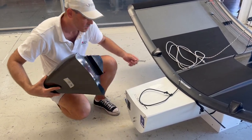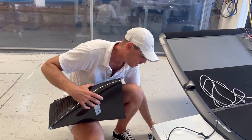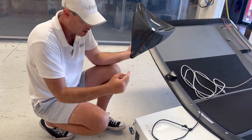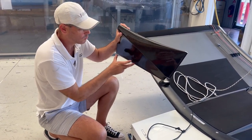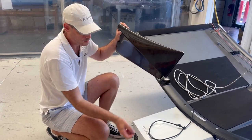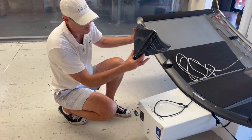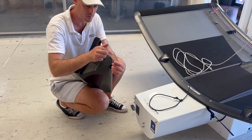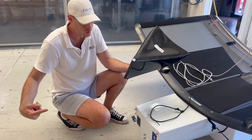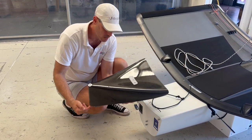You will definitely need a 10mm ratchet spanner — very difficult to do this without one. You also need a long spanner that goes through here; this is an M10 nut, so you'll need a half-meter-long or two 250mm extensions. A long-arm spanner with a socket — you wrench that up through that hole. Get your nut, place it at the end of the spanner, put a bit of tape so it doesn't fall off, poke it through, and the gantry will go straight on.